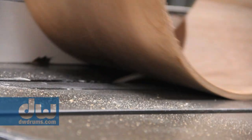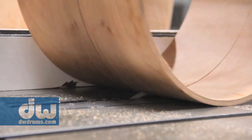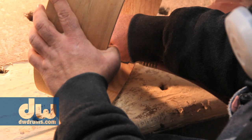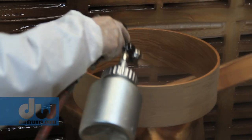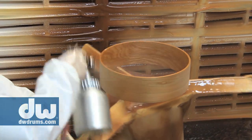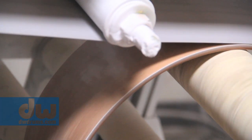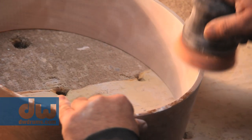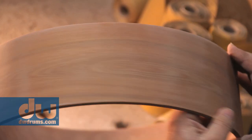Once we cut the barrels into various different sections, we trim off the edges. The next part, of course, is sanding. Sanding in and out carefully to make sure that everything is even and 100% round. Primer coat, we'll do basically 3 times. We primer coat it, it soaks into the material slightly, let that dry, we sand it, then we do it again, sand it, do it again, and sand it. So you've got 3 really nice primer coats in there, which is allowing this to be sealed 100%.